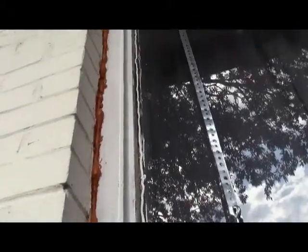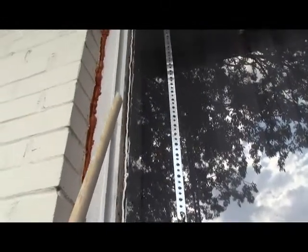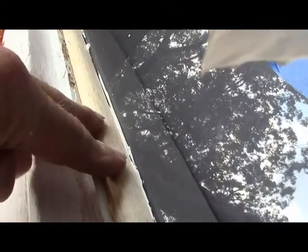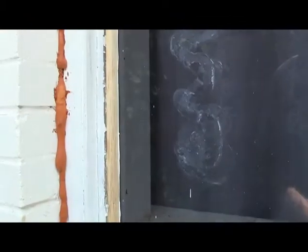It's raining right now — sprinkling. I'm catching it in between the sprinkles. Since a lot of homeowners don't have access to all the good equipment, you run a bead of silicone on the glass, put your stop on there, squash it in so the silicone squashes out well, put some nails in there, let it set overnight. That'll hold the window in place because we've already got the height established. I'm going to put the camera down and put some nails in there.